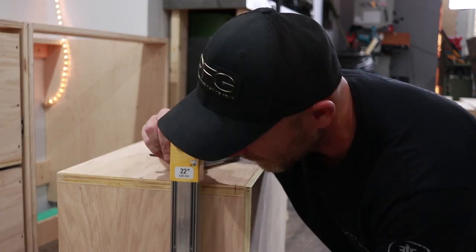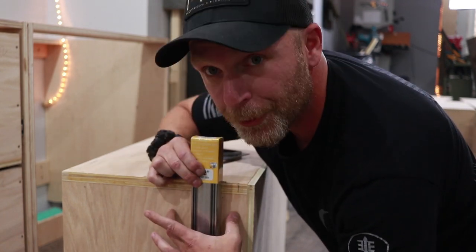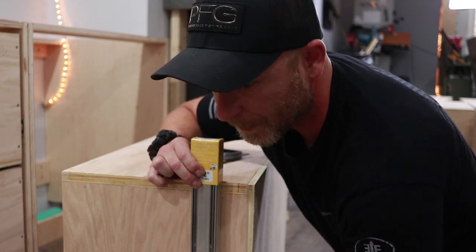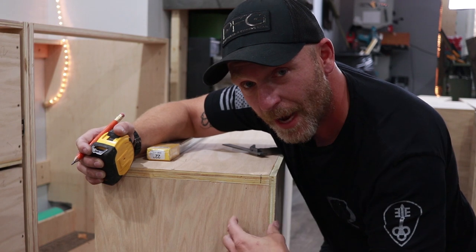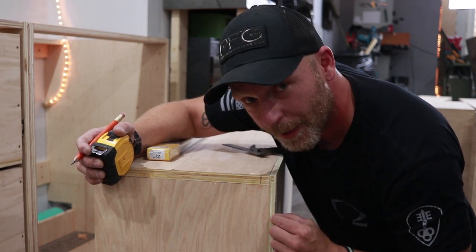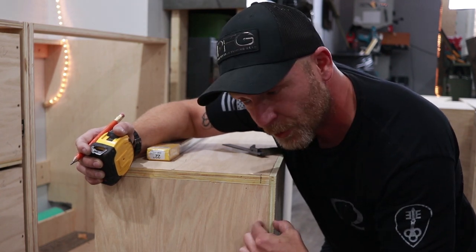At that point you don't have to shrink the entire cabinet, just where the slide goes. So hopefully that's gonna work — theoretically. My slide will go right there, but what we want to do is cut out three inches, which is the size of my planer, right down this way. Let's measure that out. Since my slide will be an inch and a half off the bottom of the cabinet, we are going to start cutting our groove — our one-eighth-inch deep groove — at one inch.